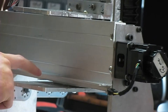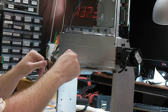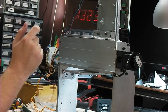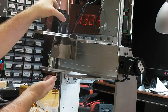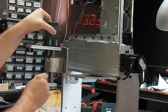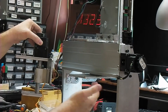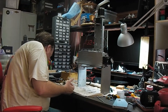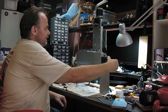Once you get the coupler in the middle so it doesn't move either way, you also need to shave the bottom part of this modesty off — otherwise the modesty binds to this panel. Here's one I prepared earlier. On the old one the bolts are right at the edge so they'd be underneath, and the modesty would go down behind this, but if you've got this coming out here it's going to bind to the modesty so you need to take a few millimetres off. That's a little trap for newcomers, but once you get it all sorted this moves by hand quite easily.